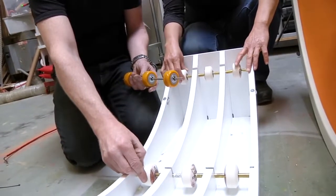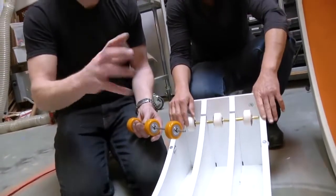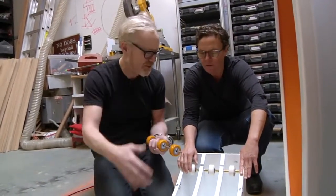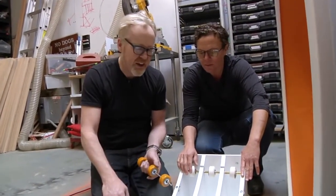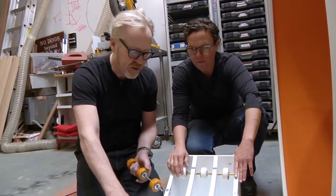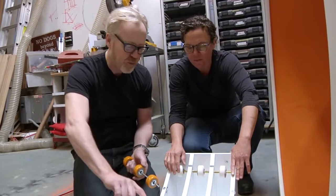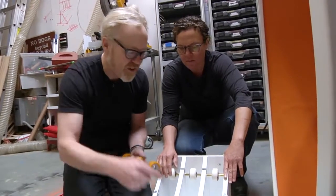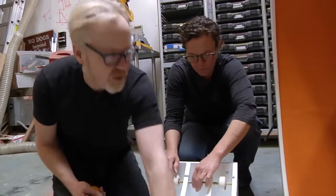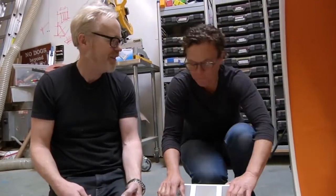None of that's good. So I went with skateboard bearings with high-quality skateboard wheels — very hard wheels rather than soft wheels. That's to lower the rolling resistance. The softer the wheel, the more contact there is — actually the more friction. And then finally, rather than opening up these holes, I went with some hardened steel shaft which I machined down to fit the original diameter. These are super strong and they're not going anywhere. One of the kids could probably get on this and not hurt it.